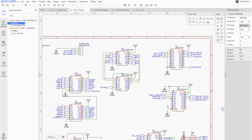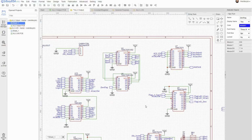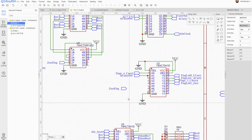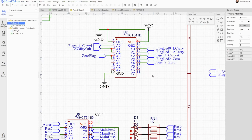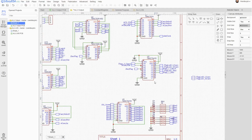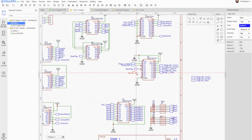Now I'm actually going to drive 2 of these line driver inputs, because I can actually pair these up to drive the LEDs and the output lines differently. So here the generated 0 flag is going to drive the LED and the main flag output for 0 from different channels. Okay, next flag is going to be sign. That one's really simple because that's just the top bit of the output. In 2's complement mathematics, this tells us if the result is positive or negative.